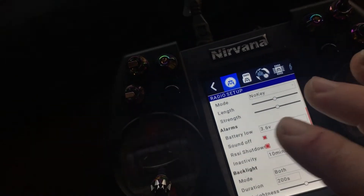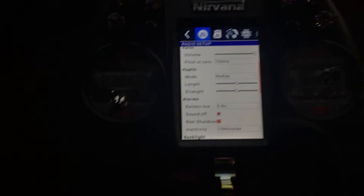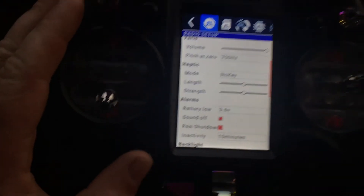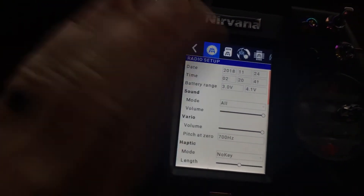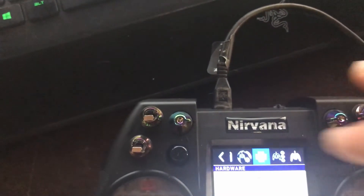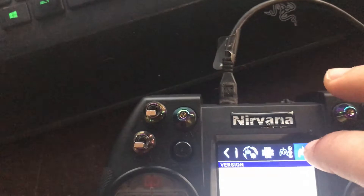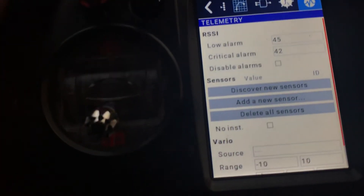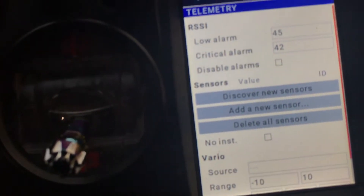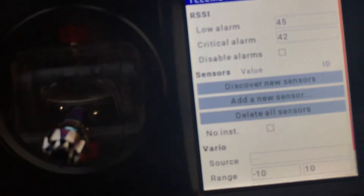The inactivity shutoff at 10 minutes is another shutoff — I'll just leave it as is. If you don't have the battery set correctly, you'll be like me when I was testing: running down to 3.4 volts. The unit will shut off when it sees a low battery — that's a safety feature. At 3.6 volts it'll alert you to change batteries. On the hardware page, the battery calibration does pretty good. For RSSI alarms, they're built into the radio and work with Crossfire, but not yet with FlySky — they're still working on that.